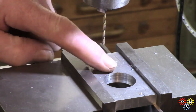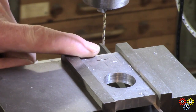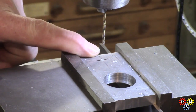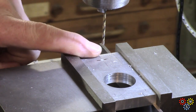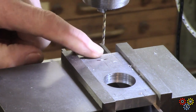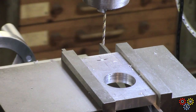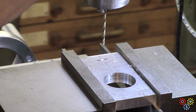Before we cut this down to profile — so it's easier to keep in the vise — I'm going to do like on the last job on the lathe, where I buried the magnets into the material. So I've got to have a fixing hole for the countersunk magnet. I'm just popping that in real quick — it's for an M3 by 0.5.